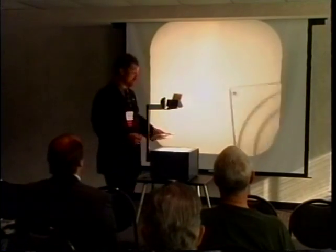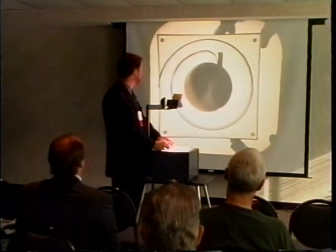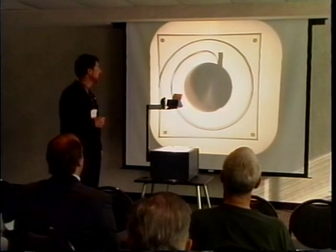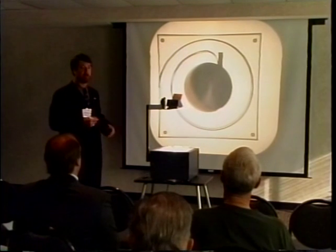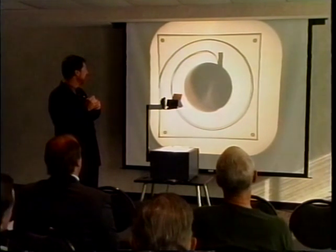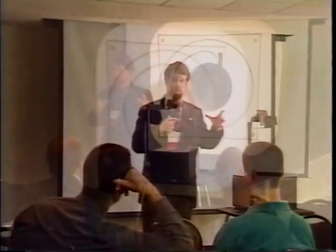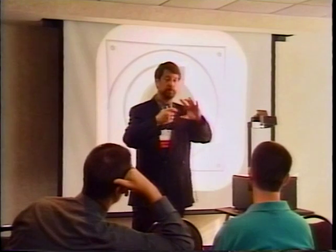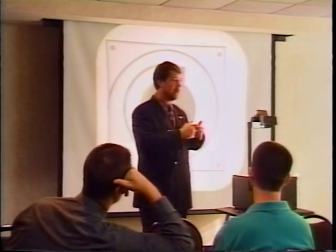Okay, so now we have this finely tuned watch and we're ready to start timing it out. Before we get too excited about dynamic poising and positional errors and stuff like that, we want to make sure that our hairspring's adjusted properly. I realize nowadays you have these friction-fit, glued-on things that can be a real problem sometimes, but the main thing is that you have your collet and your hairspring positioned properly so that, since the hairspring isn't a perfect circle, the body of the hairspring is centered around the balance staff. Now, one way of checking that, if you need to, is to take your balance off the bridge and put it in truing calipers and spin it and look for those coils to kind of explode. Like if you drop a rock in the pond, you can see the rings disperse to the outer edge.